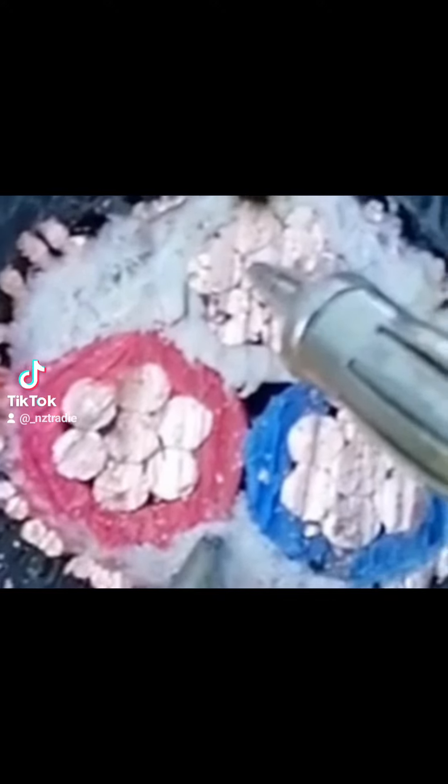The principle behind an insulation resistance test is that it passes a higher voltage than normal through the cable you're testing, and it stresses all the points of weakness in the cable. As you can see in this video, at the top above the white phase where we've cut it, there's a little bit of swarf left over from the copper and it's tracking its way through that.